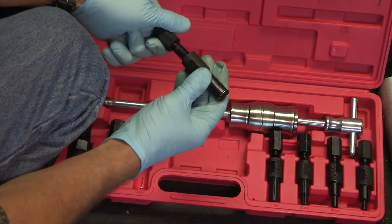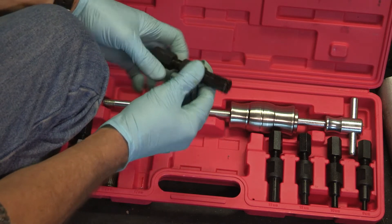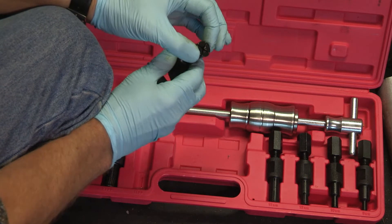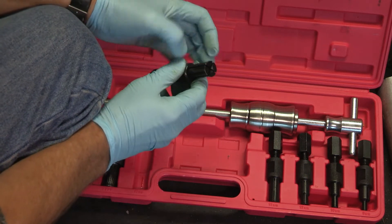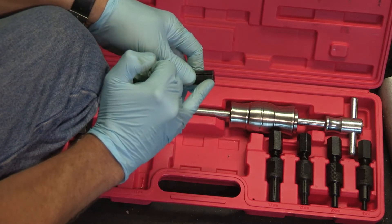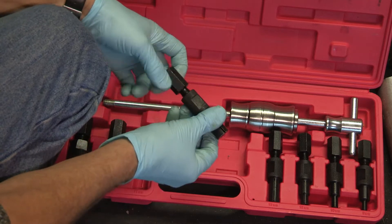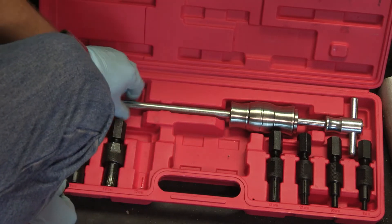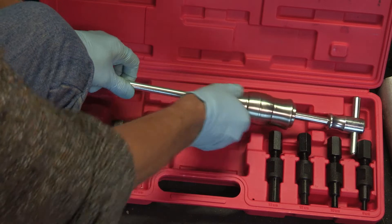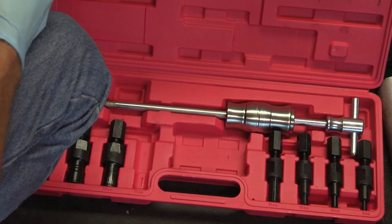Make sure that's greased. Put that into the bearing while that's in, and these ends should open up and grip the bearing from the inside. Ideally this little flange at the bottom here should grip the far end, and you can then use this slide hammer to pull the thing out — or bang it out really, it's a hammer. Well, we shall see if it works.